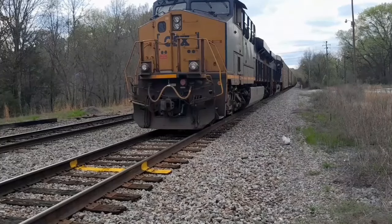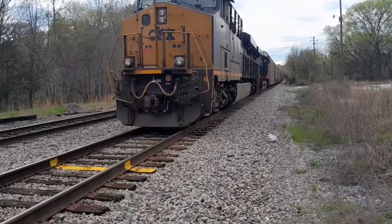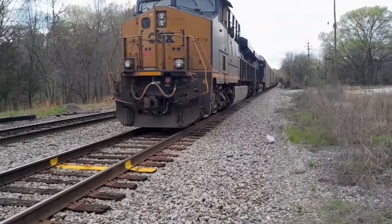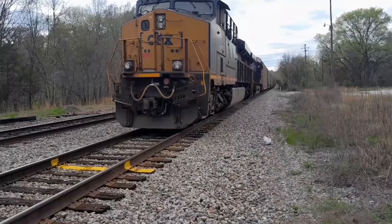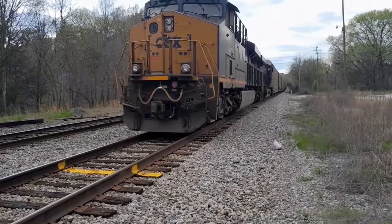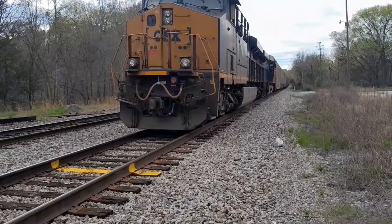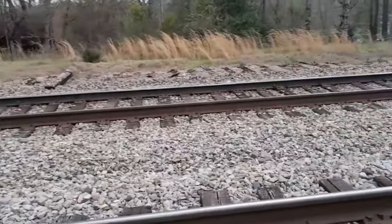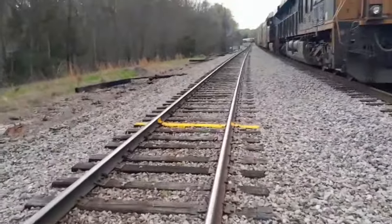All right, she's getting ready to crank up. Automatic startup. Just cranking the engines to run the compressors to get the air back up to maintain the brake. It will add air to the train line, but it's such a small amount that it doesn't release the brakes. All right, she cranked up. You hit the air compressor in a little bit. I'm gonna cross over. I can get that auto rack train pulling out.